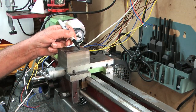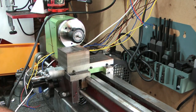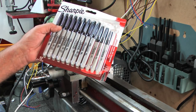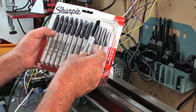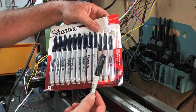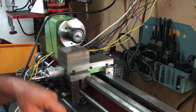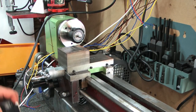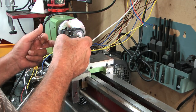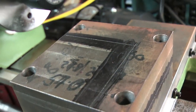Just marking the area with a Sharpie. On the topic of Sharpies — local supermarket, pack of 12 for six pounds at Tesco's on offer with club card price. That's about 50 pence each, probably 70 cents in dollars. They're fine point, which is fine. I'm going to locate the tool post on there, measure the width, increase by four millimetres and scribe a line, and do the same on the other side.